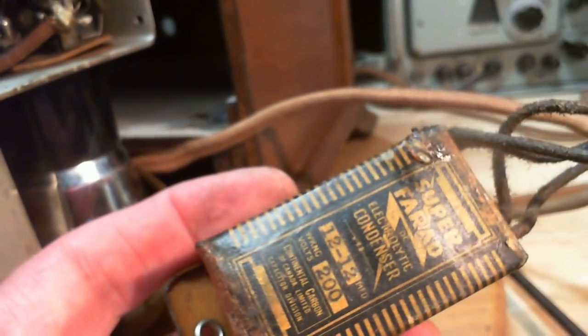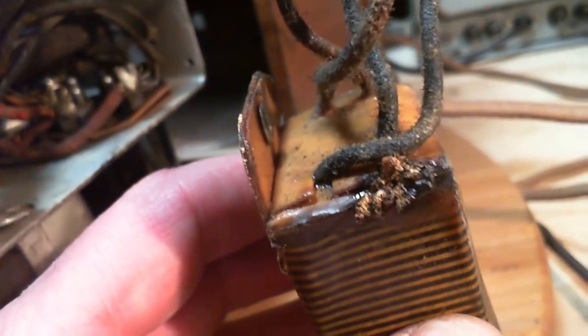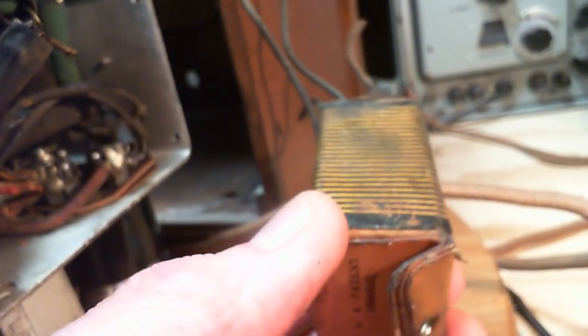Let's take a closer look at what we got. DC electrolytic condenser. 200 volts — not very high. They've got paper wrapped around it and there's something written underneath it. Blue, green, yellow. For some reason they've covered this — the original print has been covered. Maybe the marking department came in and said we can't sell these brown ugly things, we want to make them look like bees and then they'll sell. I asked for the wires — you can see they all come out in little slots. And there really are two negatives unnecessarily in the application this was put to.